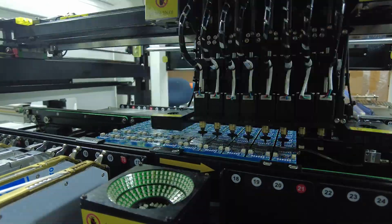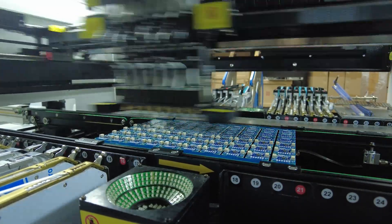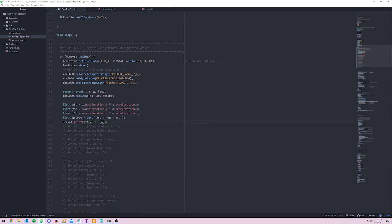With the assembly underway, I got started writing a test script. To test this device, there's actually a self-test the device can execute, where it stimulates each of the axes, and then you perform a check to see if that falls within factory tolerance. And as a belt and braces approach, I also included a check to make sure that the device is experiencing 1G for a consecutive number of samples.